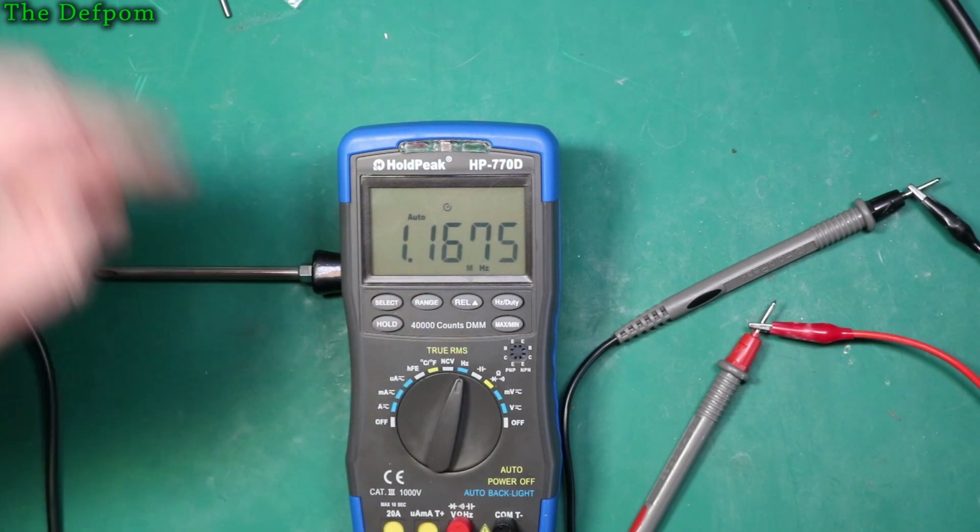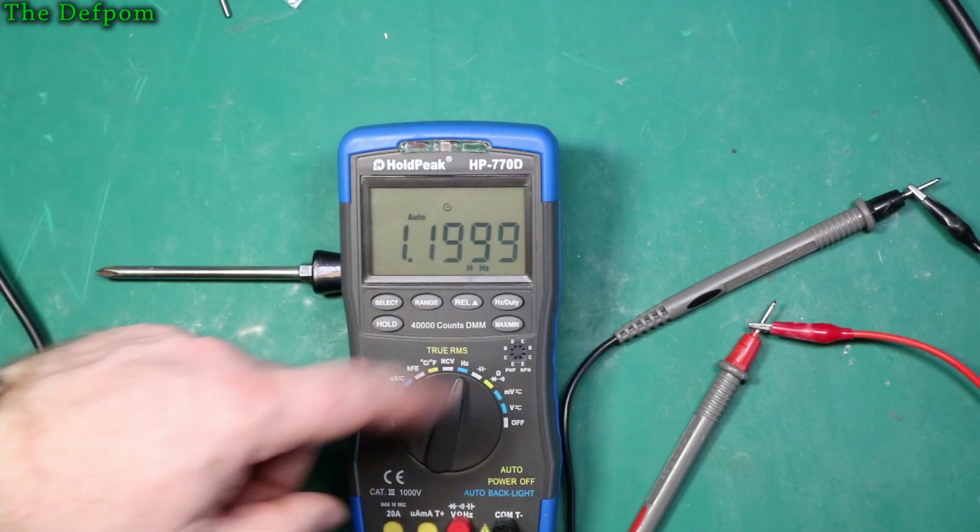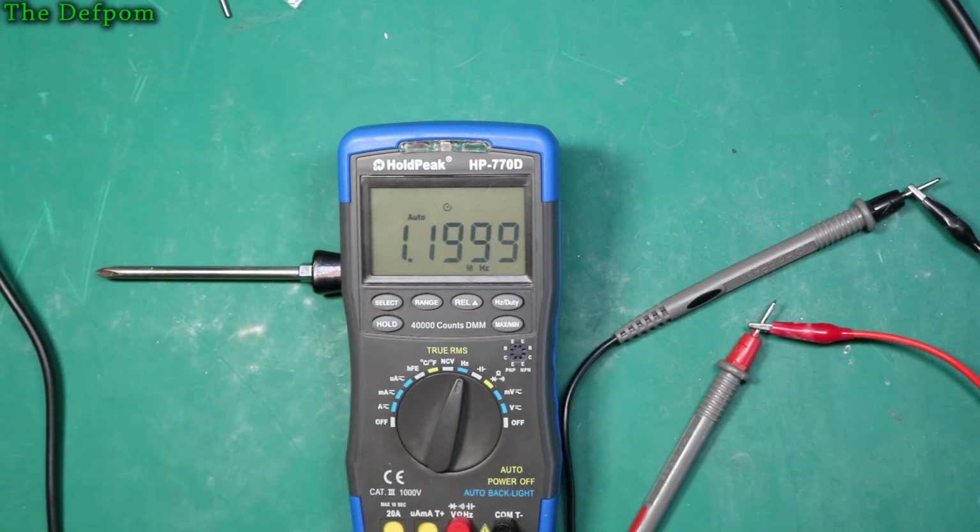Oh, it's struggling a bit there. Okay, let's just try a bit more voltage. Yeah, there's a bit more voltage there. So I did 2 volts. Now it's just about okay. Alright, let's go to 1.7. Yep. 2.6. Yep. 4 megahertz. Yep, still that too. Okay, keep going. 5.1. Yep. 7.5. Yep. 20 megahertz.